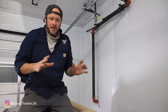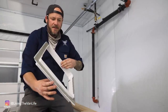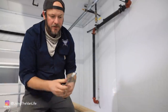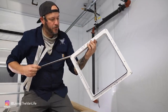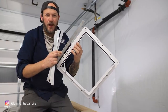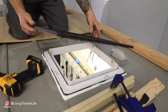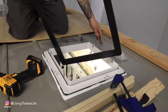The adapter ring is glued into place, everything is sealed, and it's had a few hours to dry. I've taken the Max Air flange ring and covered it in butyl tape around the outside. As one extra line of protection, I've cut some aluminum strips because this flange is plastic and I'm a little concerned that screwing it in by individual screws will eventually crack around those screw holes. The aluminum strips will screw on here and help distribute the load of the screws across the plastic. This inside part of the adapter is what will allow the screws to grab hold from underneath and create the clamping effect.